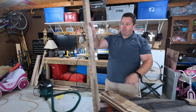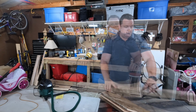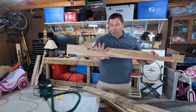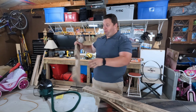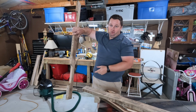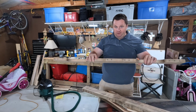So I'll make those cuts, and I'm using 1 board per each. So on this board I can do 2 cuts. Since this is a pallet wood chair, sometimes you get framework that's like this. And I'm going to use this same one and make my 2 cuts so that I'm uniform. So my leg is going to have this little notch on one of my 2 chairs. And that's because I'm using pallet wood. So I've already measured it out, I've notched it, so let's go ahead and make the cuts.